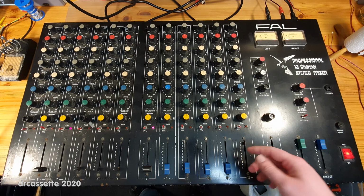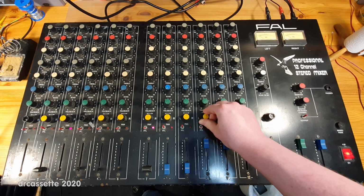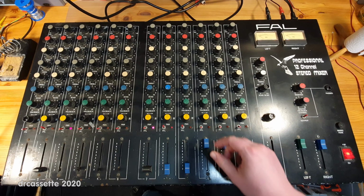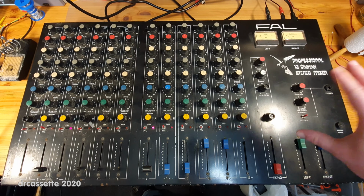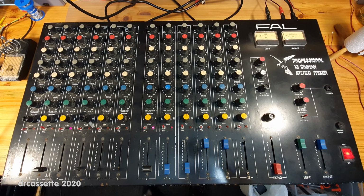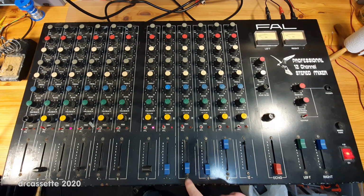Yeah, this channel definitely has some bad op amps, because this sort of noise, this is not your... Oh dear. Well, there are a lot of bad contacts in the potentiometers. But no, you can hear this sort of unsteady noise. That's a sort of bad semiconductor noise. So this channel has got a problem.